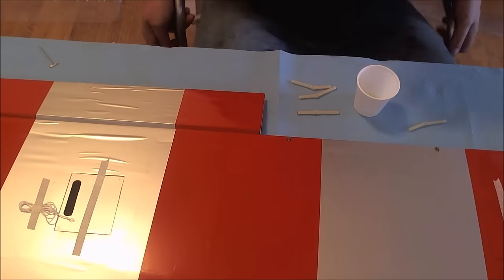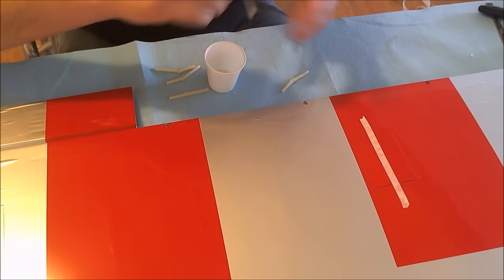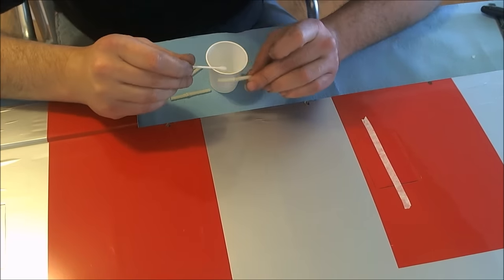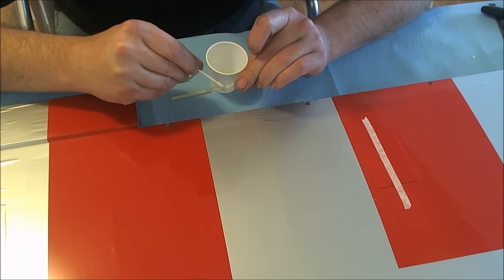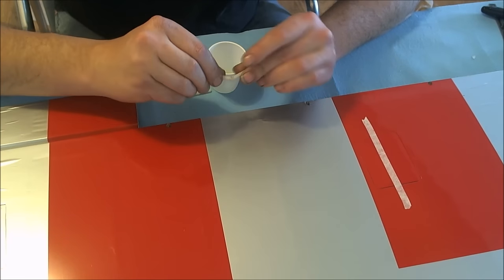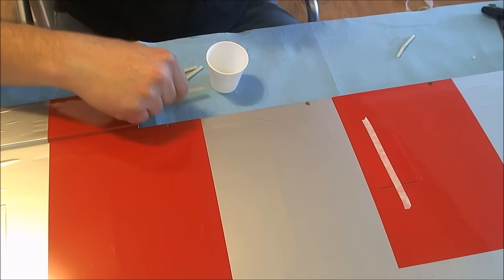Okay, I'm back. Ran upstairs, got a Q-tip. I'm gonna dip our Q-tip in the oil. Get oil in our Q-tip, and that cotton really absorbs that oil. Loads a bunch of it up for you, and I'm just gonna press that on the hinge point, right there in the pin. Get that oil in there real good. Work it back and forth, slick it up real good, and get that oil down inside there so it can work. We'll do that to all of them.